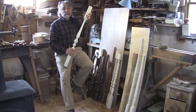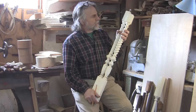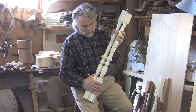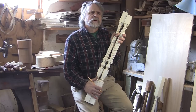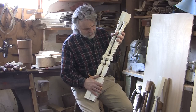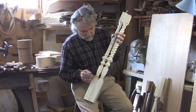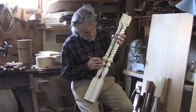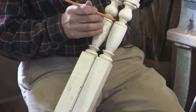Classical design can also be taken to an extreme. Let's take a look at these other two balusters. These two balusters are part of a set — they alternate A and B along a long balustrade. And they're also very much in the classical tradition, but they're from the first classical revival period, which is in the Renaissance, also known as the Baroque period. We can see the classical elements and also see that repetition and variation. The bottom urns on these are the same as each other, with a big extended urn and then a very sensual curved urn on top, with the same classic column base: bead, land, cove, bead. You'll be seeing that over and over again in turning.